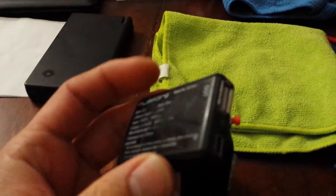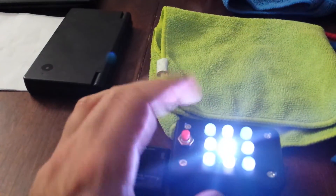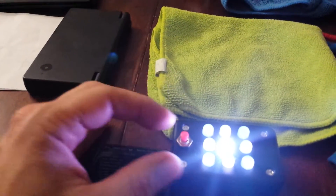I'm going to stop talking and show you how it works. Power up via USB — the USB is only for power, no data. The middle LED will light up to tell you the Arduino is ready for calibration. When you press the button, the first LED will flash red and then turn fully white, which is quite bright — I'll probably lower the number to make it dimmer. Once the white calibration is done, it's going to flash green and then turn back to white, telling you to put it on a black surface. After that it does a little funky color display, then takes a reading — and normally it should be black, but sometimes a little rogue color pops in.